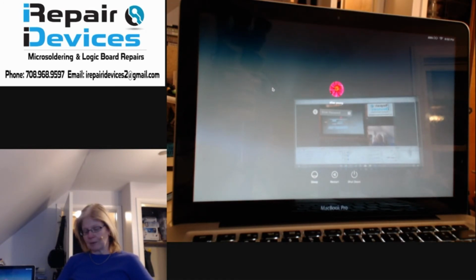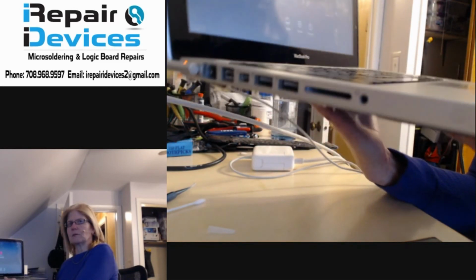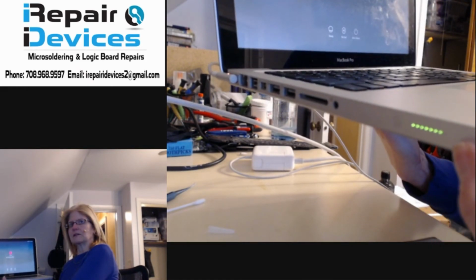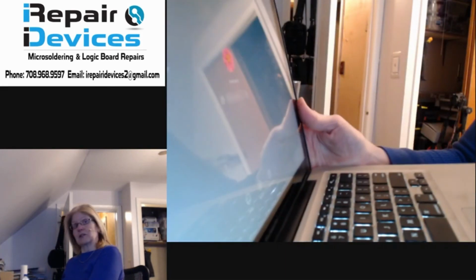And then the second issue, which was causing that red X to appear on the battery, was the battery sensing line. And what was happening was on the PP3V42 rail, I was getting the voltage, and I was getting the proper 3.48 voltage on the data line and the clock line. But I'm going to show you right here, there's an actual secondary circuitry that plugs into the main board, and it sits right along here. And when I press this button here, these LEDs light up, and this shows you the strength of your battery.